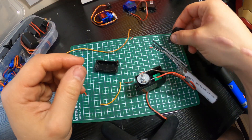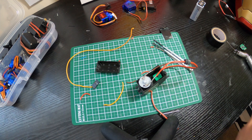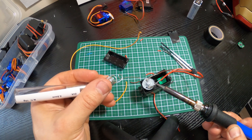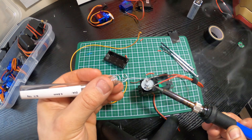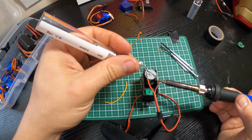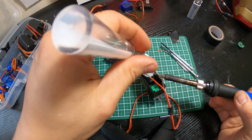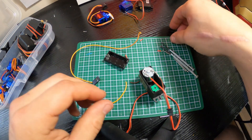I'll take just a tiny piece of electrical tape and get that ready. Then we'll solder these up real quick — just a little dot to hold them and give them strength and a better connection. Take a little bit of solder, make sure your soldering iron is hot enough, and just melt the tip. Lift the wire up a little bit, heat it up using the weight of the servo, and the solder should almost get sucked into the wire. Don't leave the iron there too long or you'll start to melt the wire. Do it on both wires — it works out really well.